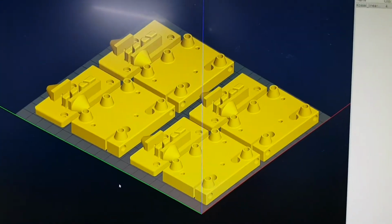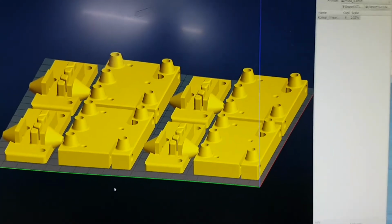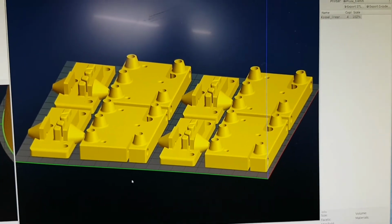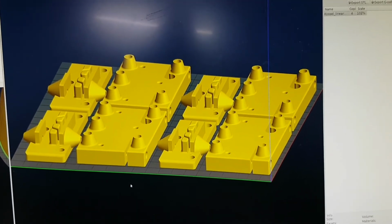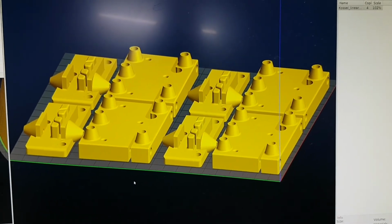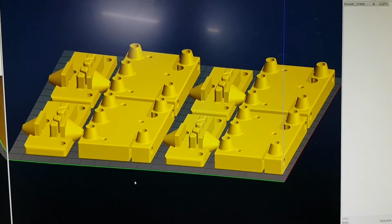And here's the model from the STL. I've pretty much got my print platen laid out. I only need 3, but I've laid up 4, just in case. All these threads are being held with taps directly into the polycarbonate. If I accidentally damage a thread too much, by having a spare part I can just jump to the next part. So I've got a spare of each kind of part here. Anyhow, I suppose I better get that into the printer and start printing.